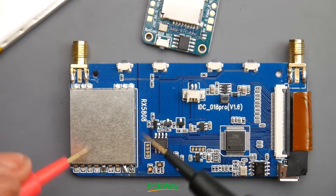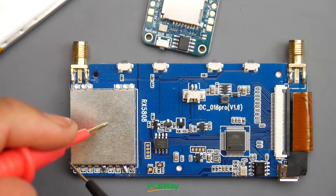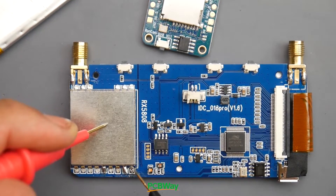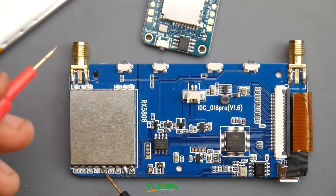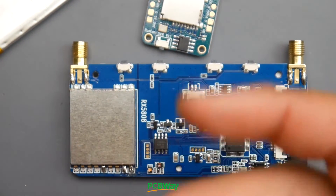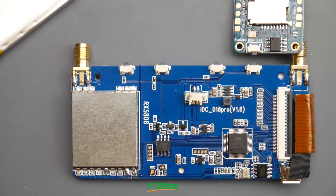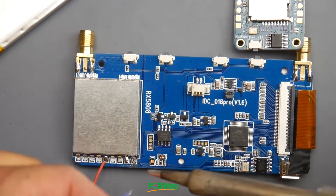What I like to do first on these — because usually most of them, like 95% of them are identical — is I put it in continuity mode, hold the shielding, and just touch these here. So we see we have a ground here, and this should be a ground. Usually when you find the first ground on the first pin, it would be video, audio, RSSI, and then the voltage. So this is going to be the 3.3 volts or 5 volts depending — here it's battery voltage. So we need this voltage and this ground, and we're going to take it into our step-up converter to change the battery voltage into 5 volts to power the DVR.